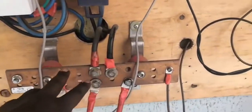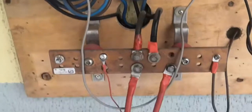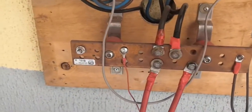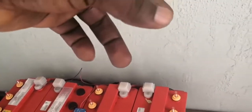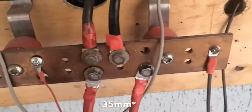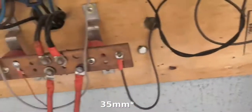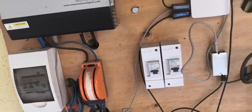I have some accessories. The way I connected my batteries is using two bus bars — a positive bus bar and a negative bus bar. The system is configured so that all the positives from the batteries connect to the positive bus bar and all the negatives connect to the negative bus bar. I use 25mm cable of equal length for this configuration.